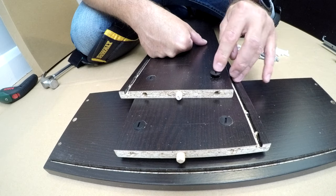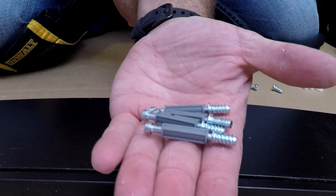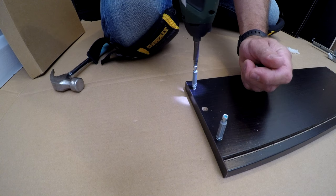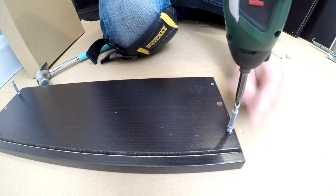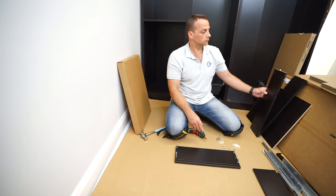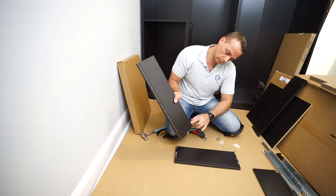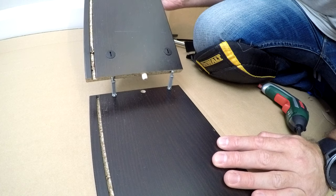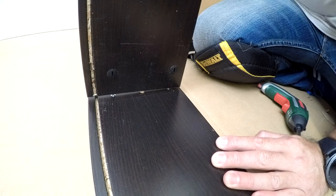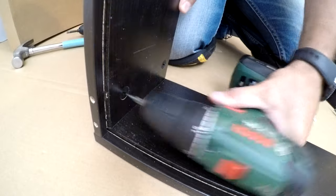You can see there is the hole and there is the lock at the front. Now we can take screws - you're going to need two screws on each side for the front panel. Just secure them in, but don't go deeper than the stopper or higher, otherwise you're going to have a problem putting the side panel in and locking it in place. The side panel has a small gap and there is a gap on the front panel as well, so they're going to line up nicely with the locks on the inner side. Find the holes, place it all in, and once you have no gap you're in the right spot - just secure the locks by twisting to the right.